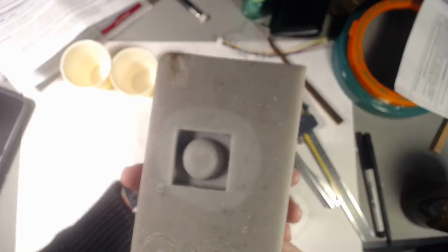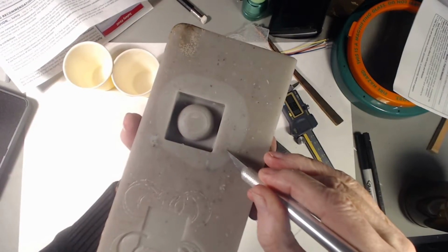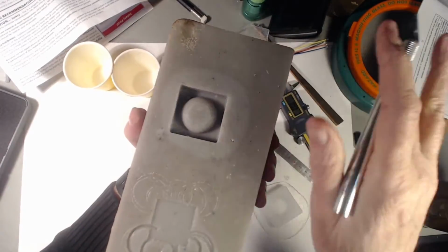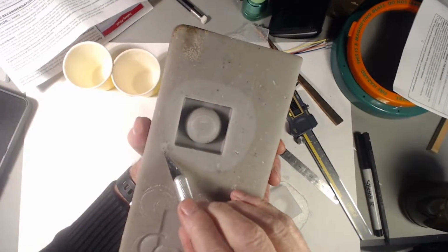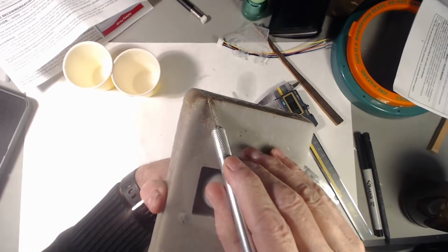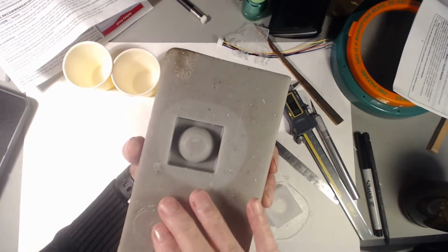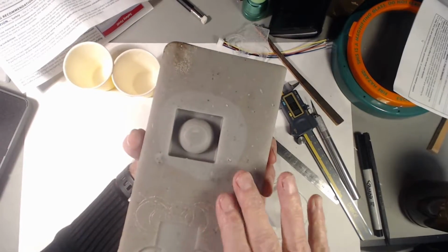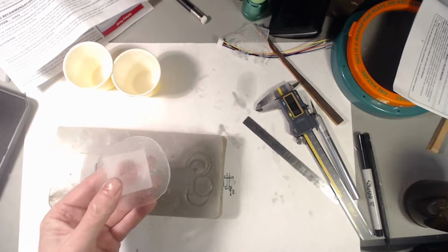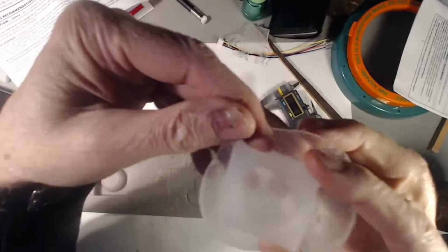It looks like you could make tens of duplicates out of this wax mold. And you can see this piece of wax is very dirty. It has chips in it, aluminum chips from a previous milling operation. It's got pieces of sawdust in it. It's got grease in it. This is all just melted together with plastic bags and stearic acid. So this is my worst piece of machinable wax. Still looks like it's probably good enough to make pretty nice objects.